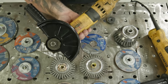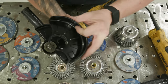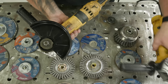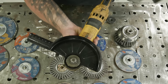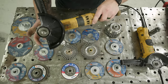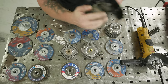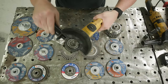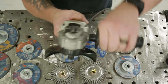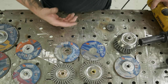If you switch to a five or four-inch wheel, reduce the size of your guard accordingly. A grinder capable of running four and a half, five, and six-inch wheels is versatile and preferable. The smaller grinder is much more compact, lightweight, and easier to use. Choose what's going to work best for your shop and your application.